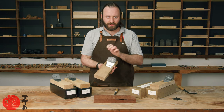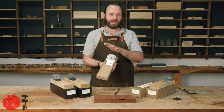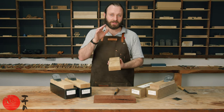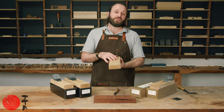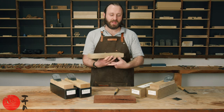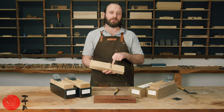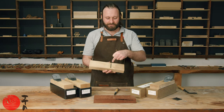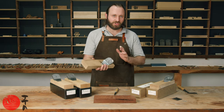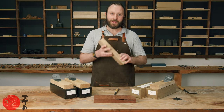I have seen 25 of these particular blades sharpened in classes with Takami Kawai when we were making our own plane box with him. The blades I have seen sharpened over and over again with great results, and this particular plane with its block and its Tsutsumi is a real joy to use. I will say that Toshio Odate's observation about having to do more tuning work behind the blade — I would agree with that. This plane does require tuning from time to time behind the blade as the Tsutsumi bows out. I hope that's helpful in explaining what that little shelf in your Japanese plane is. Happy woodworking.